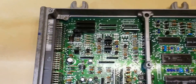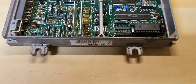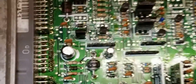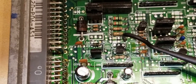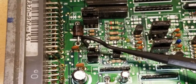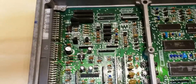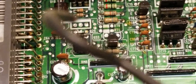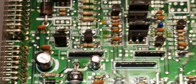The main area we're going to be working in is the top left corner, with the ECU plugs oriented to the left and the ECU sticker facing you. The main area right now is the R70. We're looking at R70, R71, the Q29 — which are these three big circles here — and the diode D14 right underneath it. We have to get all those desoldered.